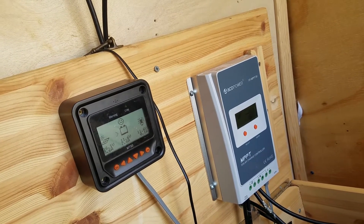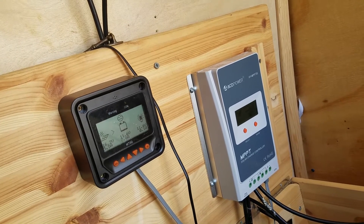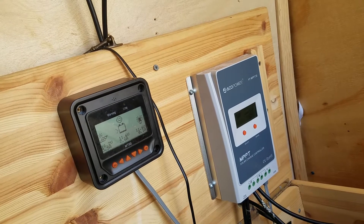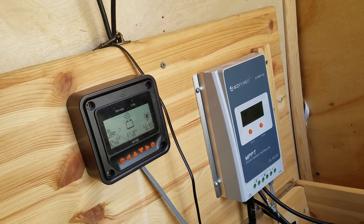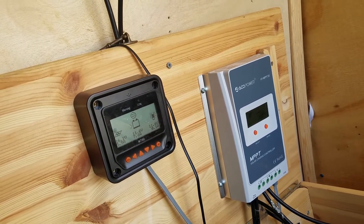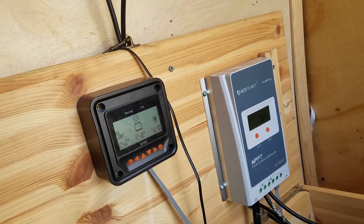...this is multiple times I have to do this: if the battery gets back down to a certain point, I have to unhook the battery from my solar charge controller — my MPPT charge controller — at least the negative, and put it back before it begins to read the current charge. The current charge is not great, but it is going up.